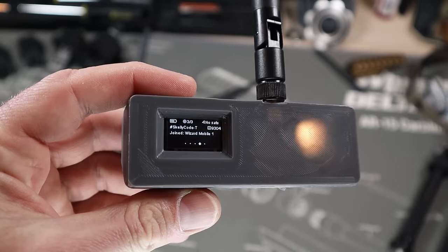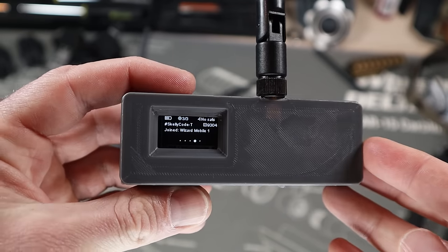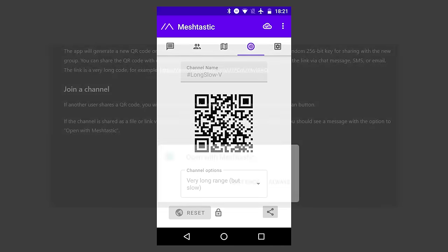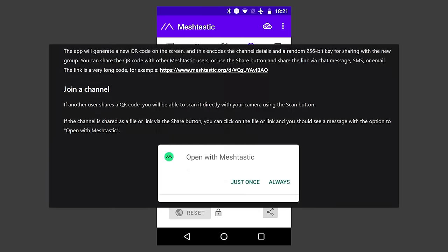And no, you can't just name them all the same thing. The network needs all the encryption keys. So you use the little QR code when you make the network, and then configure all of the nodes using the same encryption and keys with the QR code. I just took a screenshot of the QR code and then I printed it out so I could set up each node using my phone. It sounds like a more complicated concept, but it's really actually not that hard to do.